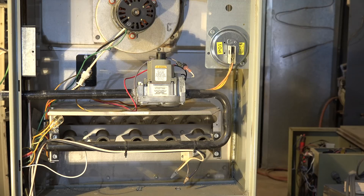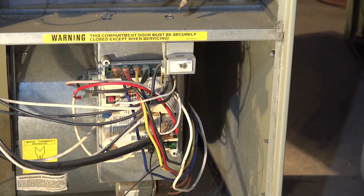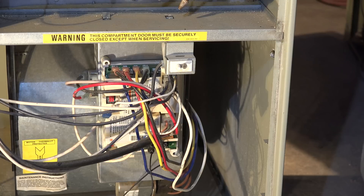The IFC right down there is going to blink a code — I'm not going to walk you through the code, but it's going to blink a code saying temperature overheat. It'll cycle back on as soon as the furnace has cooled down enough for the burners to come back on.